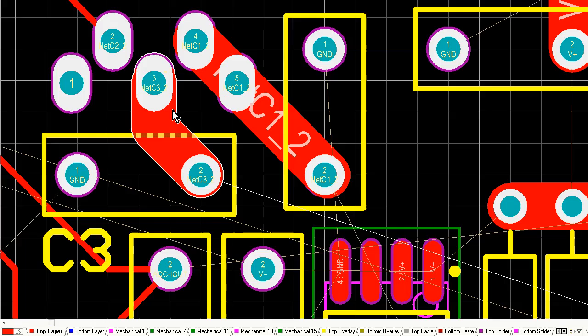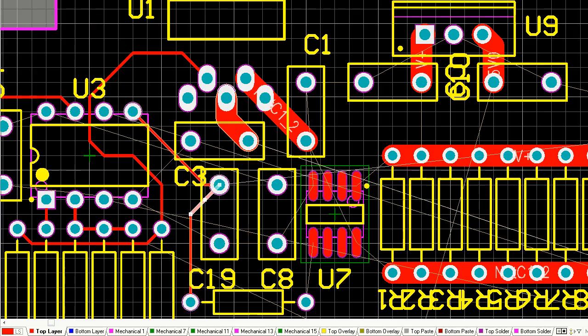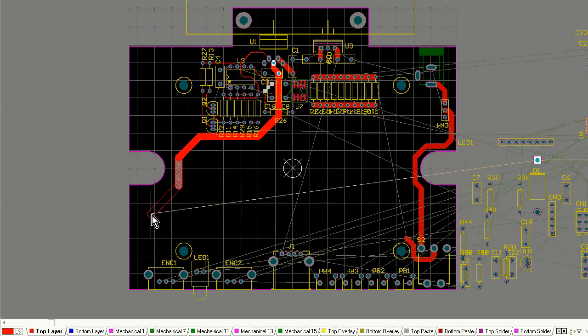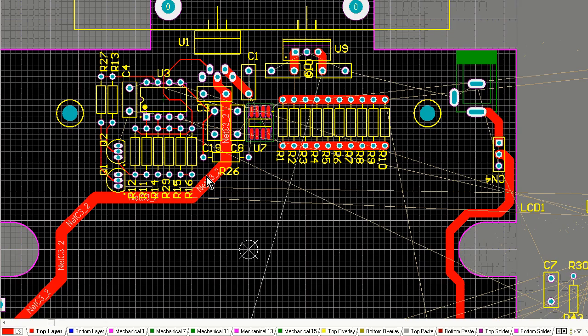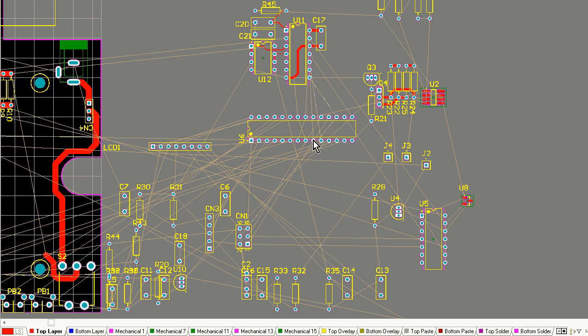So it has to be right next to the resistors. You can't have those traces going all the way across the board. The bypass caps are going to be near those caps. This one I'm placing at the moment, that's the output of my voltage regulator. I'm trying to get that down to the front panel somehow, so there's less wiring inside the unit, but you'll probably see that trace change further along in the design process.